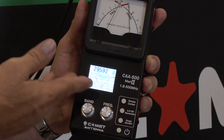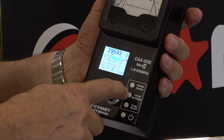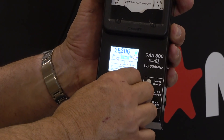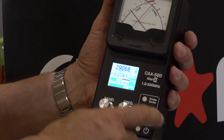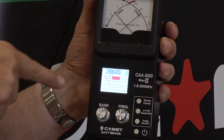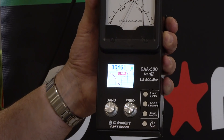You can paint a plot of the SWR across the band. As we determined, we're a little bit high, so we have to make a change. I can emulate that change, and on this particular analyzer it's great fun. We've made a change in the length, and now we can paint a different color and it will show the effect of our changes. If you don't have two hands free, you can always come back here, push the button, and then the machine will paint the picture itself. It has an automatic sweeping mode that will draw a picture of the SWR curve, so you can keep one hand free — holding onto the tower, holding onto a wire, things like that. And now we've got a pretty picture that's been done automatically.